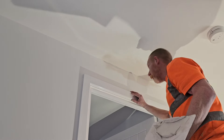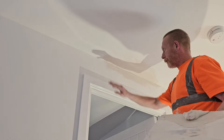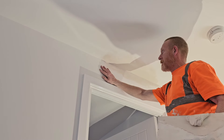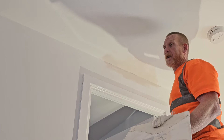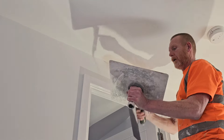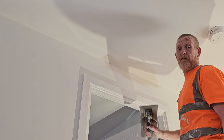We've got our first two coats on and it's firmed up a little bit. We're going to give it a top coat. Normally I'd use a joint cement or a light pre-mix filler for this, but because it's been minus seven, all my gear has gone frozen. So I'm back with the same easy fill — I've just wet it up a little bit, added a tiny bit of water to make it that little bit thinner. I'm going to come across, pass my first two passes, get it tight in that corner, and get a finish on it without sanding.